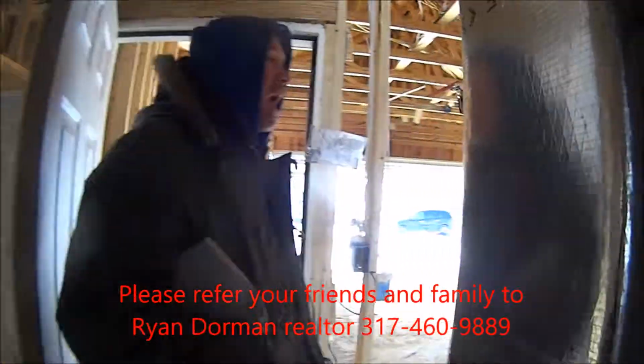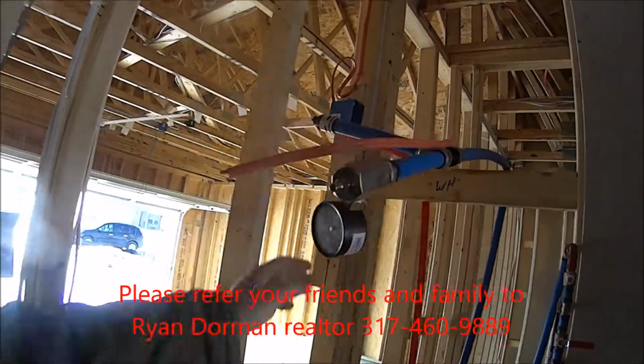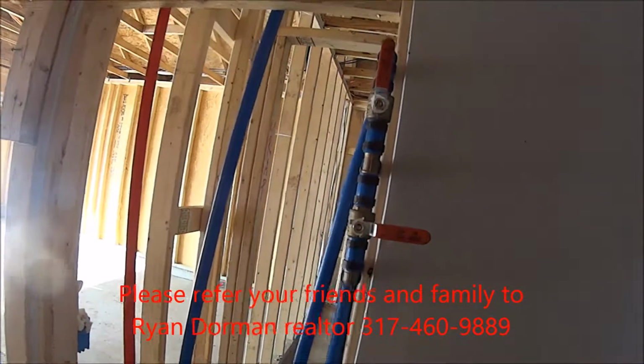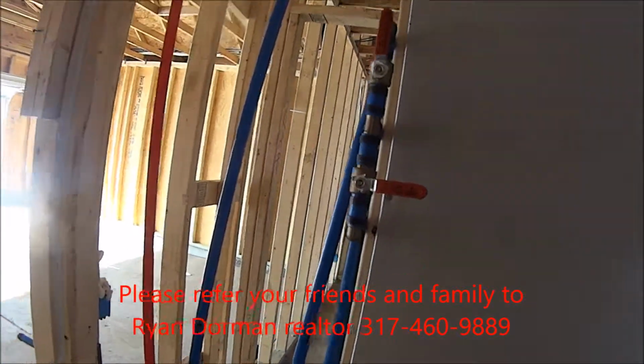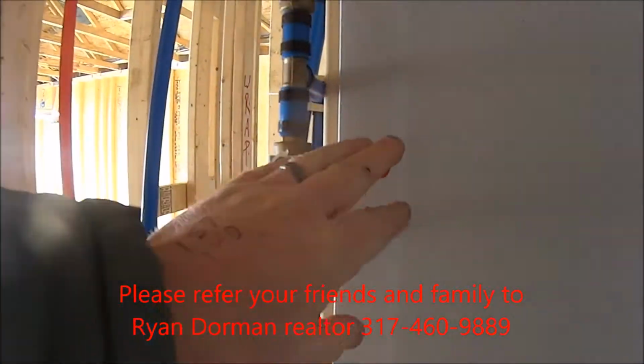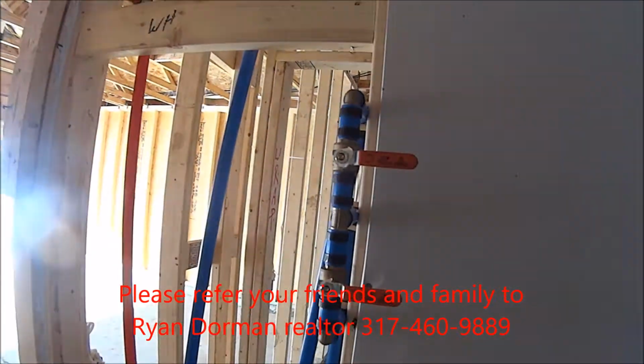This here is where your hot water heater will sit. So you will have cold supply, hot leaving out. You will have a shut-off valve like that there on your water heater if you ever need to isolate your water heater. Those two shut-offs there. The bottom one is the main, so that shuts off water to your whole home. This one here is for your exterior hose bibs.